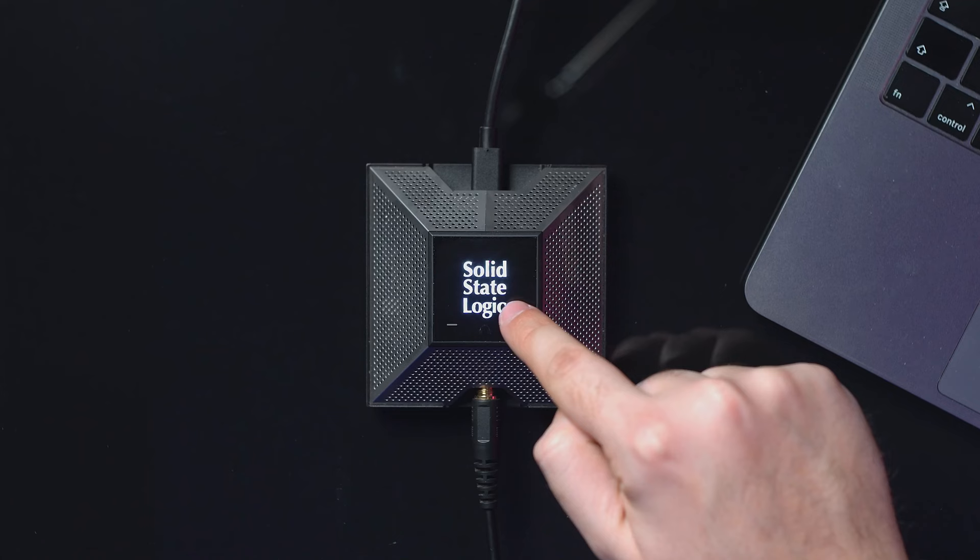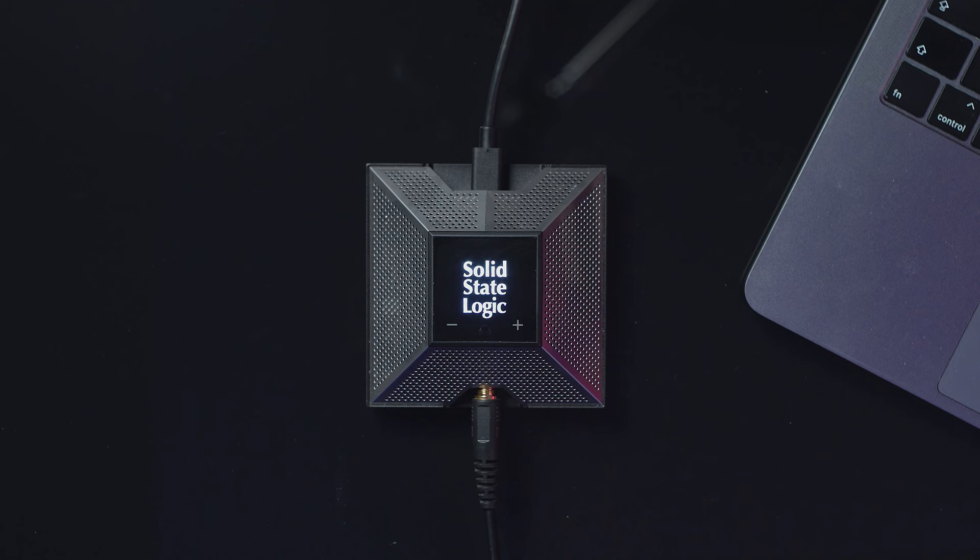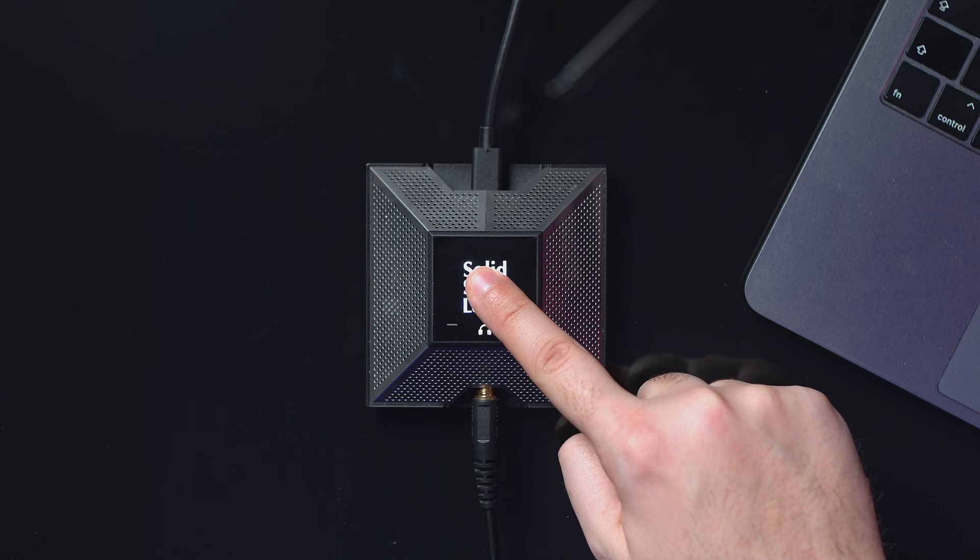You can use Immersive mode for post-production — for example, if you've recorded a conference and you want to adjust the levels of the four individual microphones afterwards. Every eight seconds the Solid State Logic logo will blink yellow. To exit Immersive mode, go to the setup menu, press and hold for five seconds, and the SSL logo blinks red — indicating Immersive mode is now off and the separated capsule recording is no longer active.